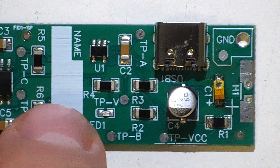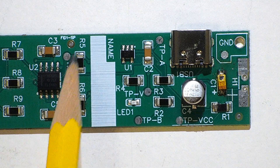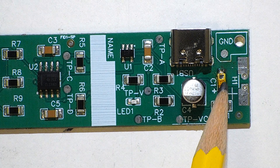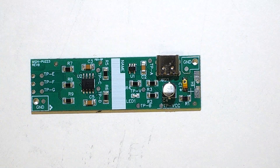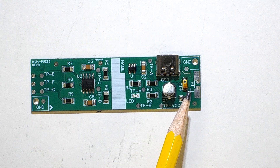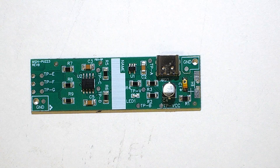The outside parts of the circuit board are actually slightly burnt, it's hard to tell with the light. When I measure this capacitor electrically, it measures as a short circuit — which capacitors really shouldn't do. Rather than go through a whole bunch of diagnoses, measuring this and this and this, all I looked at was: there is a blown component on this circuit board. If I replace this component, the entire circuit board will function. Occam's razor at its finest — the simplest solution is most often the solution to the problem.